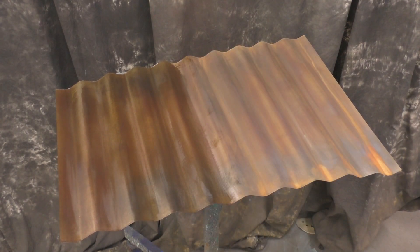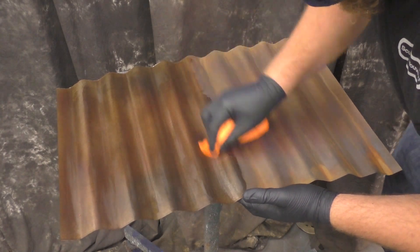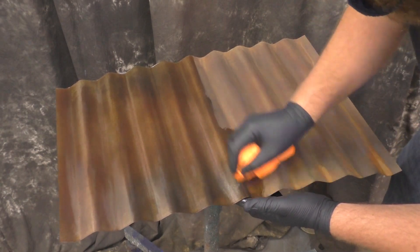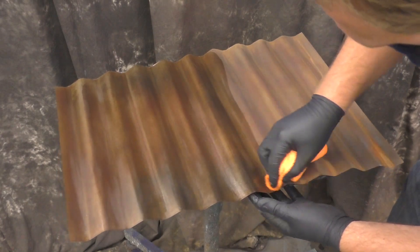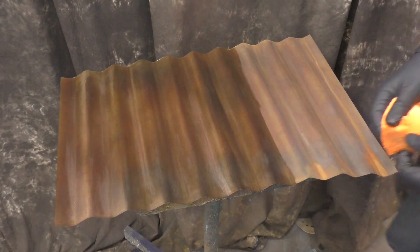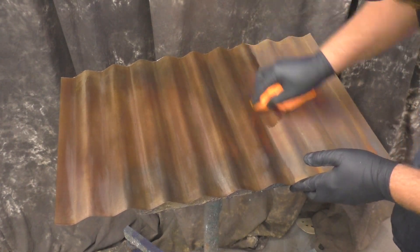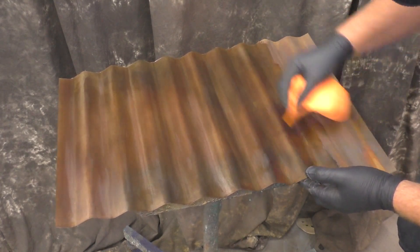If you're working on a roof like a shed, keep that in mind. I'd normally recommend doing it later in the evening when the air has cooled down a little bit, or earlier in the day — not at noon, since it's going to be hot up there. The faster the metal oil dries, the more uneven it's going to appear. We usually talk about the metal oil as a fantastic pause button — you can oil it and then Ever Clear or Clear Guard it, essentially sealing it in later with another sealer.